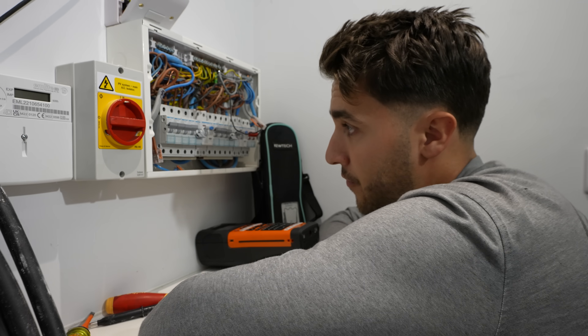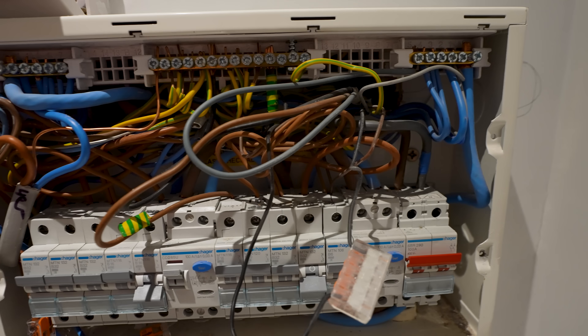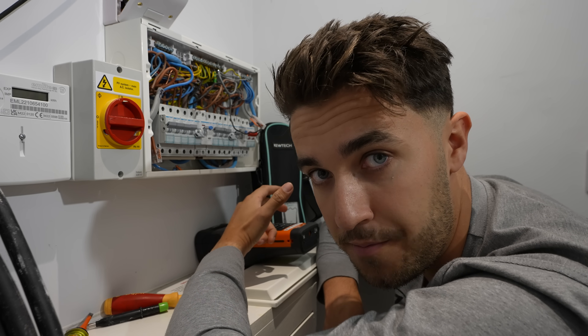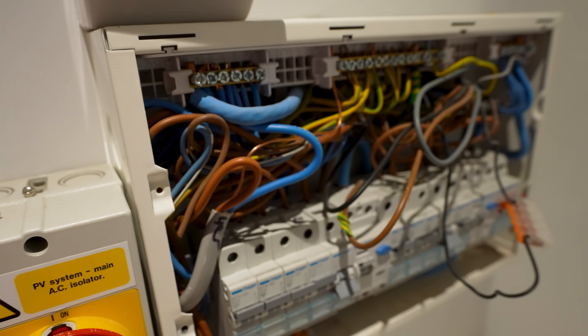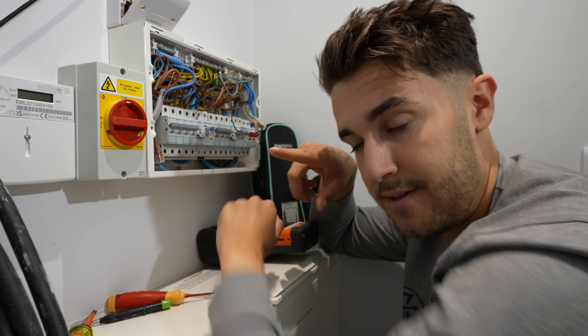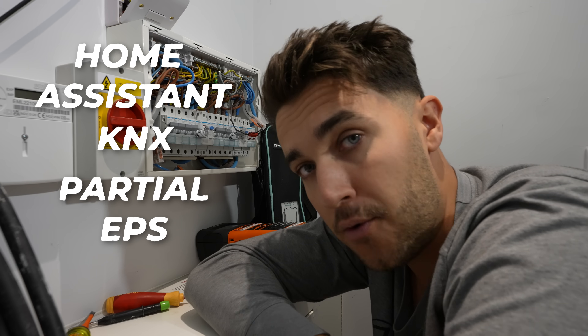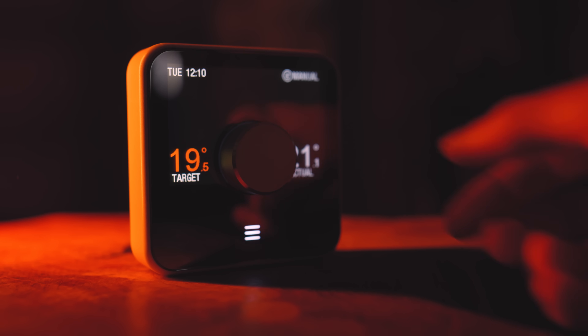So this is my consumer unit here which, as I mentioned, is a real disgrace. I don't know whether it was left like this by the builder or the last person who lived here, but there's no reason for the electrics to be this bad. I've found multiple live cables in different rooms — underneath my bathroom sink I found a live cable, just coiled up, stripped back. My plan today is to fix all of this, but more than that, I want to make it a little bit spicier. I've got exciting plans involving Home Assistant, KNX and partial EPS. EPS is a bit like UPS — if the power cuts, you've got a battery to keep your house running, but a few milliseconds slower, significantly cheaper and easier to install. I want my fridge, lights and heating to keep running — a few essential circuits — everything else I'm not too worried about.